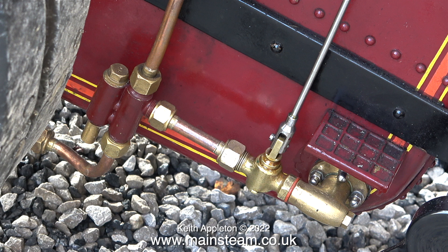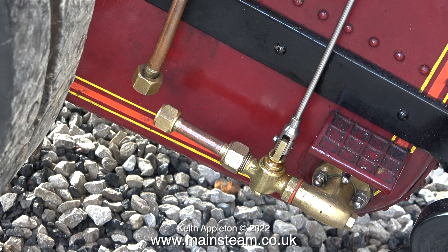I've redone the water inlet supply. The top pipe in this photograph is the steam pipe, and when I open the steam valve in the bunker a high volume, large amount of steam comes out of this pipe. If you've been following this series you'll also be aware that I modified the check valve - originally it was causing a bit of a bottleneck but it's not now. The last steam test, which I videoed, was a bit of a disaster because the ash pan was blocked up, and because of the lack of steam pressure the injector was very reluctant to start.